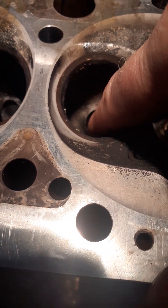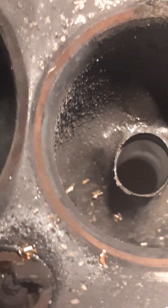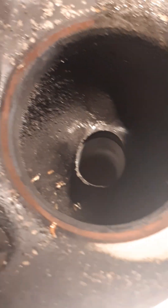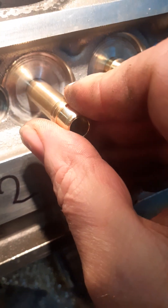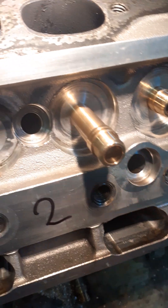As you can see here, there's also already a little recess in the bore. The backside will not support the guide very much, but the massive side will press the guide towards the exhaust flange. Similarly, this happens on the intake side. So I made this recess and it will just fit right into the bore for the beginning - just maybe one hundredth or even less play.